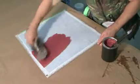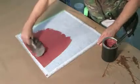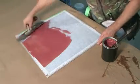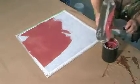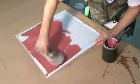Glitter Rock Smooth is an acrylic plaster with microspheres suspended in the matrix. This product trowels very easily and can be tinted to any color, metallic, or pearlescent. Begin by troweling the first coat smoothly and lightly across the whole surface. Allow this coat to fully dry.